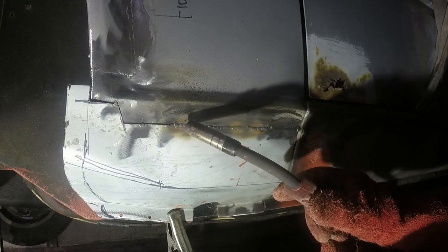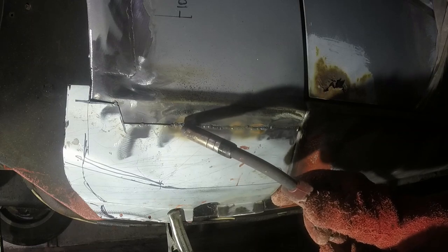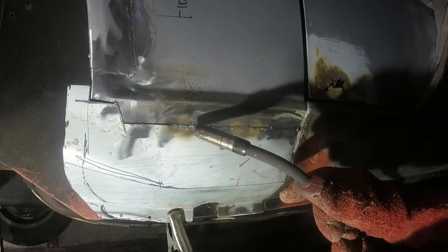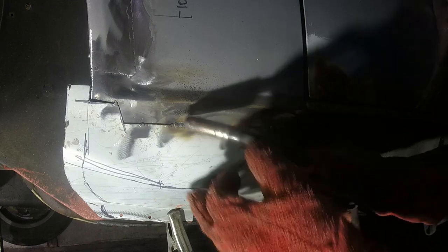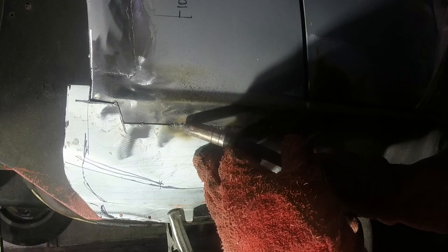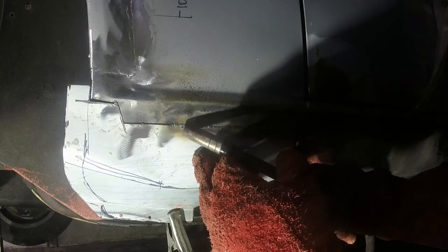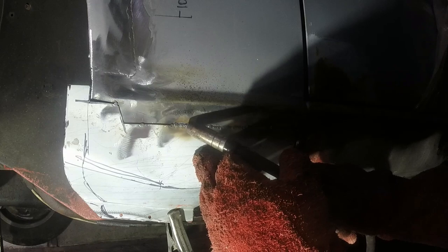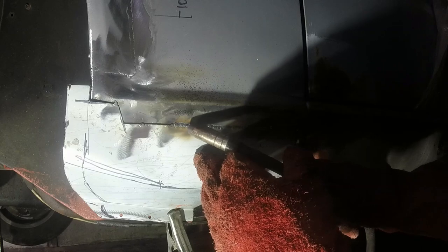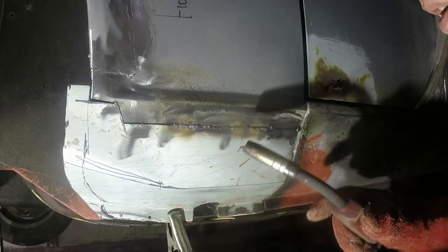But when I do it, I weld a tack, and the first tack I hold the trigger for quite a long time, so it gets hot and puts all the heat in the metal. And then after that, the length of time I hold the trigger is a lot lower, because if I did the same length, it would just burn a hole. But I work back from the tack I've just done, because I know that that tack, when it was put in, was decent metal, where all of the paint and the oxides in that area had been burnt off. And although I'm not pushing gas onto it, I'm welding so soon after that weld was formed that it doesn't really matter. So I'm welding backwards compared to what people, I think, tell you to do, but it seems to work better.